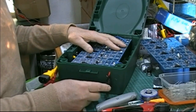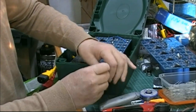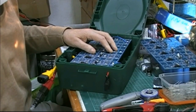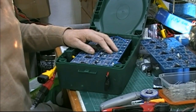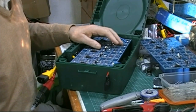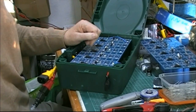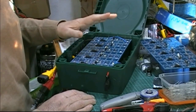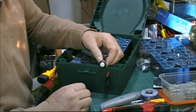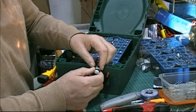This is a 25 amp automotive fuse. The reason for the 25 is because this is a 30 amp power battery pack. The push button, which I spoke about earlier, will go by this fuse — not too far in, so I can get the cables out easily. So that'll be okay. It's what they call a momentary push button.